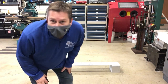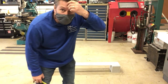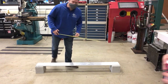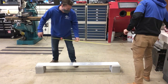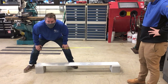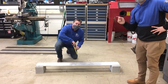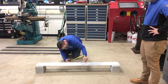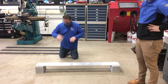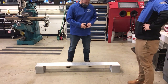Mr. Race is going to help me out and hopefully not make any jokes during my video. We are going to calculate how much I weigh based on how much deflection is in this beam. Our span — write this down — is 51.5 inches. That's the total distance. Preloading height is six inches off the ground.